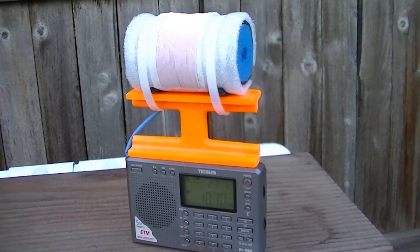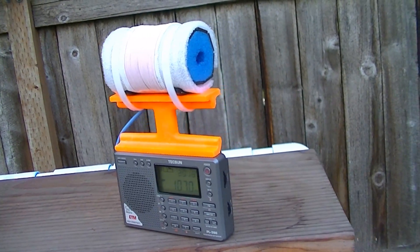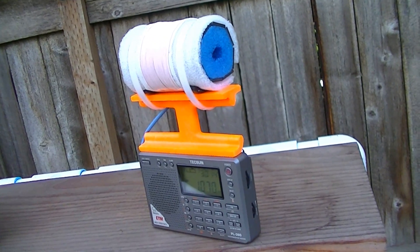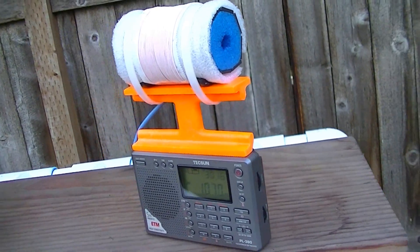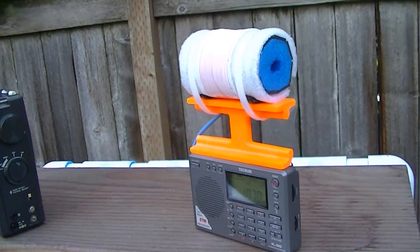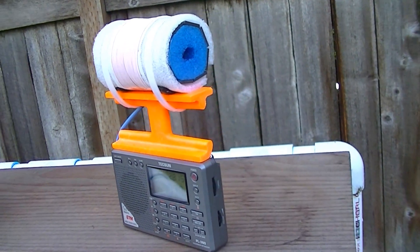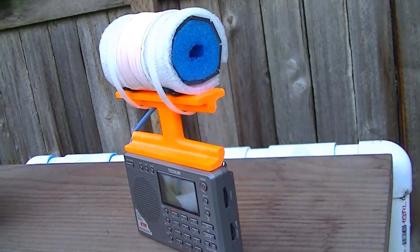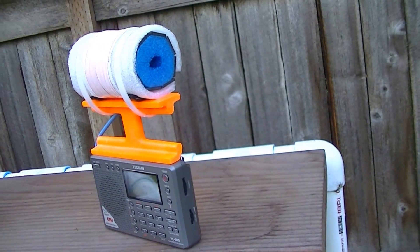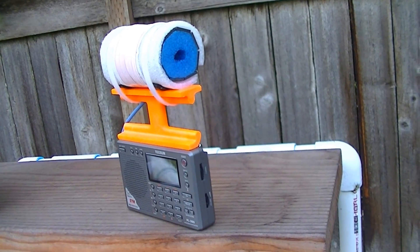As you can see, this ultralight radio has been seriously enhanced with a hardwired 3-inch bar FSL antenna, which is transplanted directly into the radio in place of the loop stick. This particular size of FSL antenna, the 3-inch diameter, is just about the largest size that the DSP chip inside the radio can tolerate for maximum RF power.